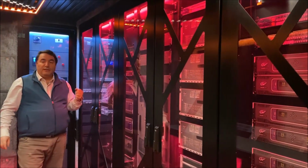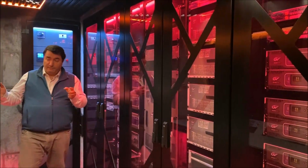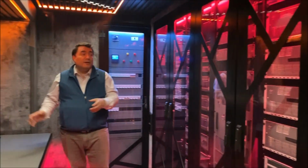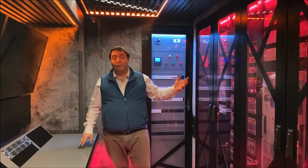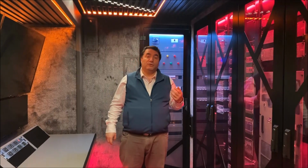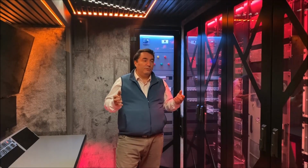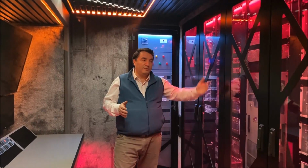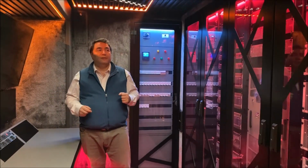The second one is, of course, for sound dampening. As people will be operating here, and some of the devices will have huge fan noises, like if you have a 4K multi-channel video server like EVS or its competitors, you will have a lot of fan noise. So to be able to suppress that fan noise, this barrier is also very useful, so that the operators have a less noisy environment to do their tasks.